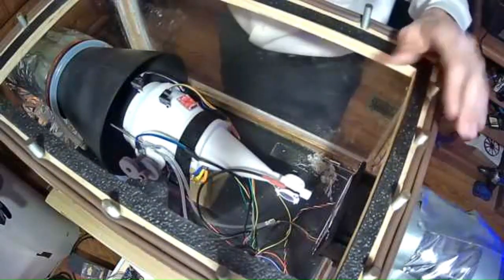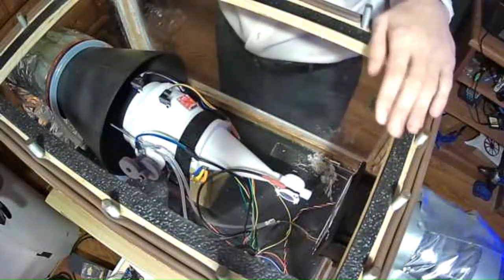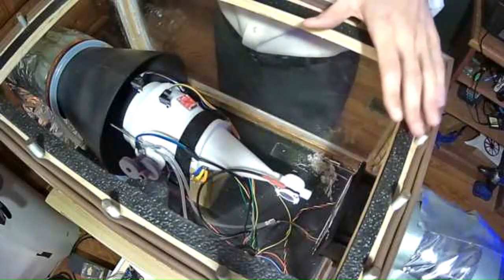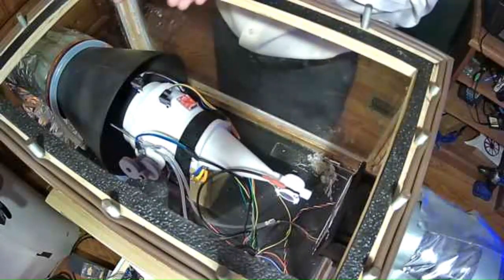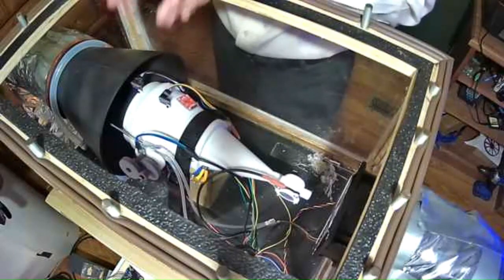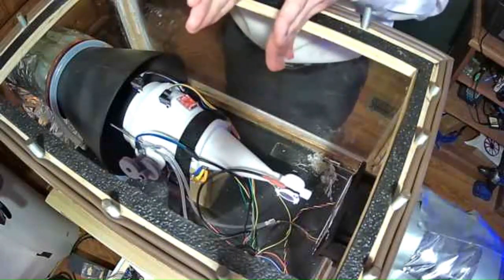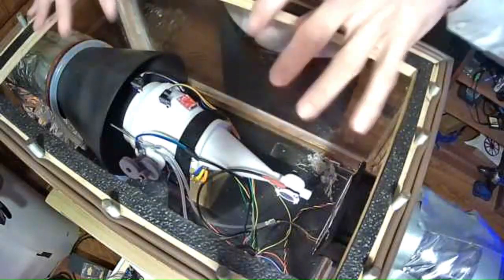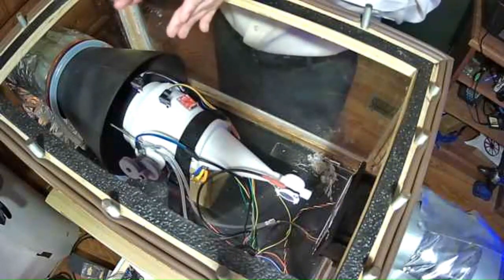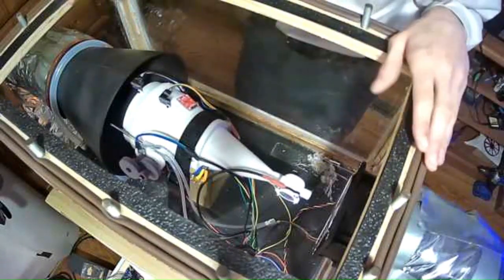And the last thing I have is a compressor on this. There's a lid that will go here, and it has 2 needle valves, so I can control the pressure inside pretty precisely. One of them goes to a compressor so that I can pressurize this entire chamber. That way I can change all the variables that I need in order to go from one stage to the other. I can put one rotor in here, run it at ambient conditions, get the data off of it, and then say I want to build a 4-stage compressor. Then I can take the final conditions off that first stage and make the ambient conditions in here those conditions. And thus, effectively, I can run the test again and call that the second stage of the compressor. And that's pretty much it on this entire machine.